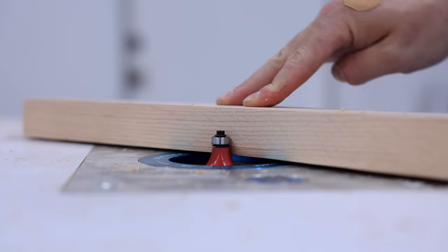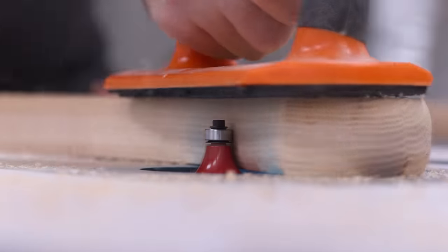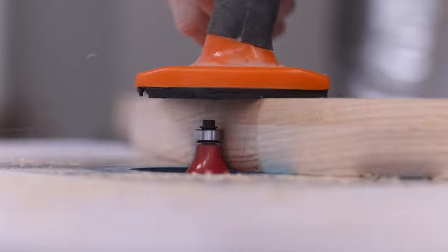I've got all the parts off the clamps and sanded, and now I can add a roundover to the two assemblies that make up the seat. The seat is joined by four stretchers, and I'm going to try something new to make the tenons.